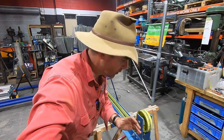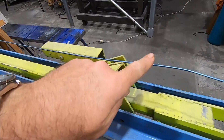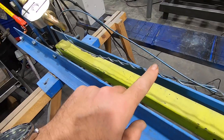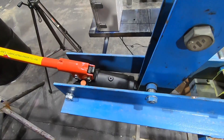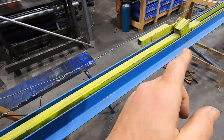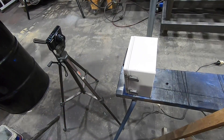The test bed itself is quite simple. At three metres in length, it's a simple pulley at one end with a wire wound around it, joined together by a Spiral Fast. You've got your single piece of wire running down the middle, with all joiners placed in the centre of the bed. It then joins into another Spiral Fast as the wire loops through a set of digital linear pull scales, connected to a lever operated by a hydraulic jack. As we jack this up, we increase the pull on the wire, measured in kilograms. We start, as you should with any scientific trial, with a control.